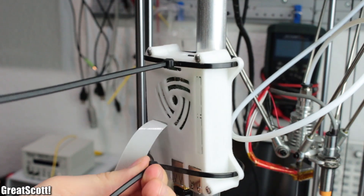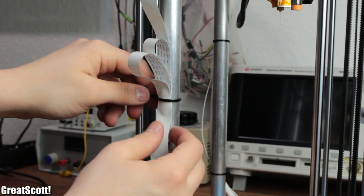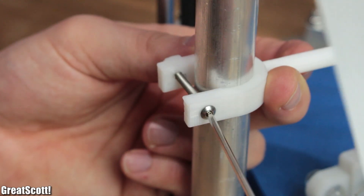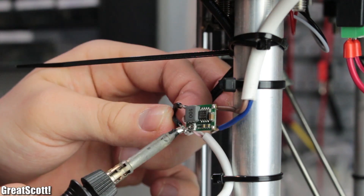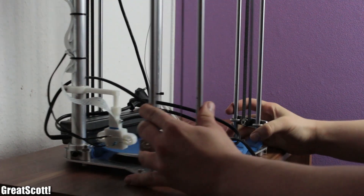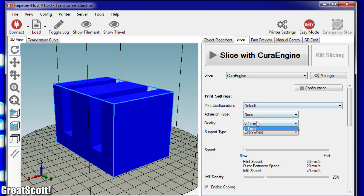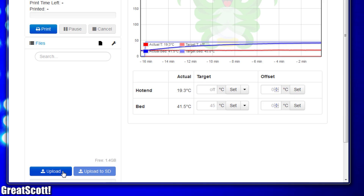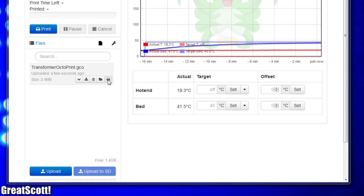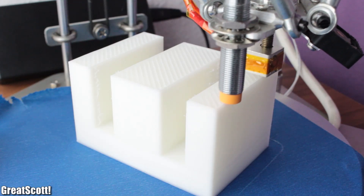At the end, I used dozens of zip ties to secure the Raspberry Pi, the buck converter, the USB wire, and camera cable to the aluminum rods. The camera base only needed an M3 bolt and nut to secure it to the rods. After soldering the wires for the LEDs to the buck converter, moving the printer to its new location, and tidying up the Pi, the project is complete. All you need to do to start a print is slice the STL file the usual way, upload the generated file to your Pi through your browser, and click print. It really is that simple, and my 10-hour print did turn out successful in the end, even without the printer sitting next to me.